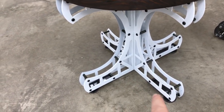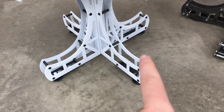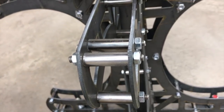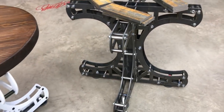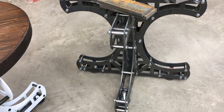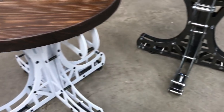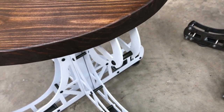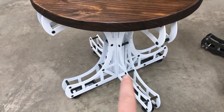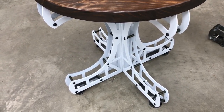The holes in it are a clearance hole for quarter inch bolts. So these are quarter 20 bolts that are 2 inches long on this one. And then these just have some threaded rods that I cut down, and some spacers. These spacers here are ones that I got from Home Depot and cut down to size. It's just tubing from the steel rack at Home Depot. I think I paid about 12 bucks for those. And then these are actually brake lines, which I paid about $6 for, and you need somewhere around 5 or 6 feet total. There's 36 total spacers and bolts that you need for this configuration.